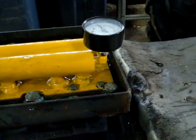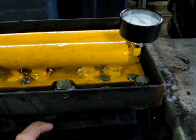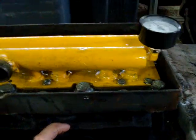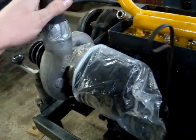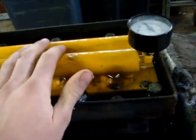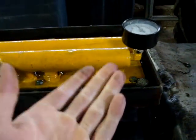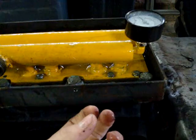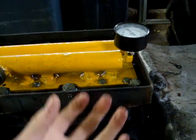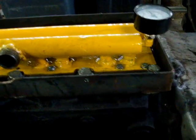And so what happens is, as the piston goes down, there's a slight vacuum plus gravity, and also a bit of air blown from the supercharger. It's not necessary, but it helps. I'll get to the valves in a minute. The valves then drop down, basically opening, and that allows the air being blown in, and also the suction created by the piston, to draw all the air in.